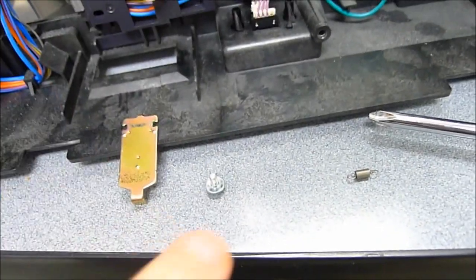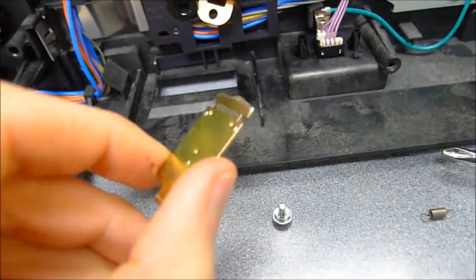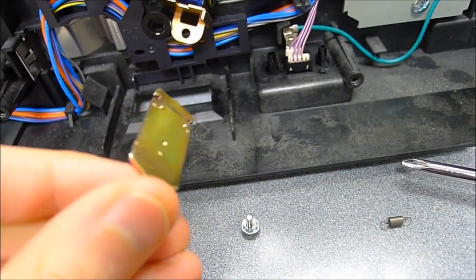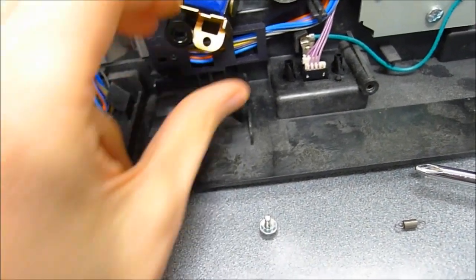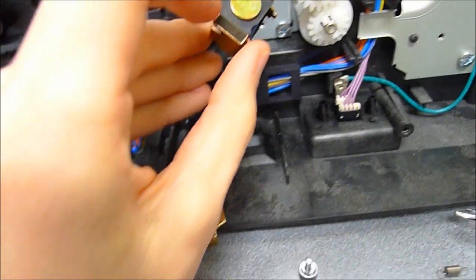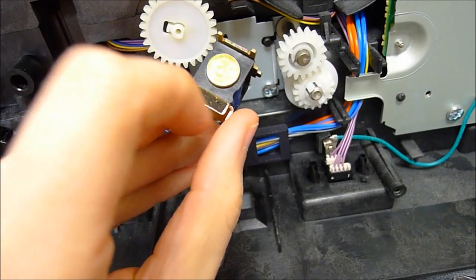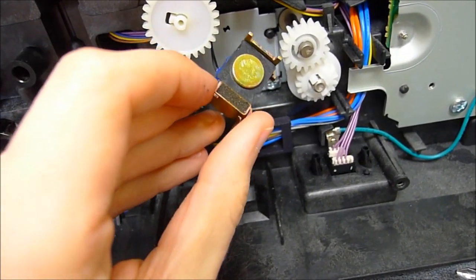What you can do is remove the spring from the solenoid that holds the armature in place. Just turning this into the light here, you can already see that there's all kinds of black gunk caked on the top and bottom — that's the remainder of the bumper. Here's a bumper right there, and there might have been a little bit of one up at the top as well. So here and here, we need to get all of that stuff rubbed completely off.